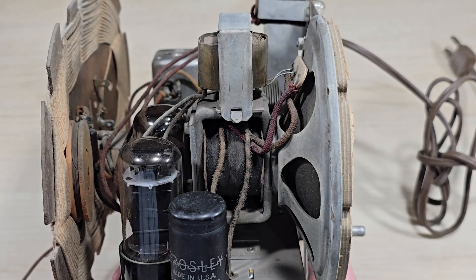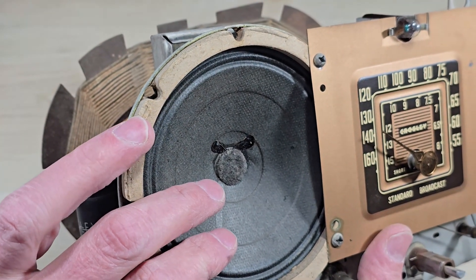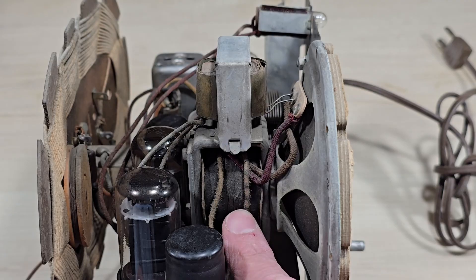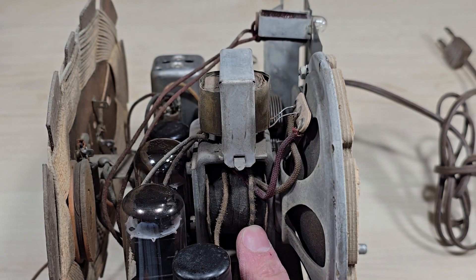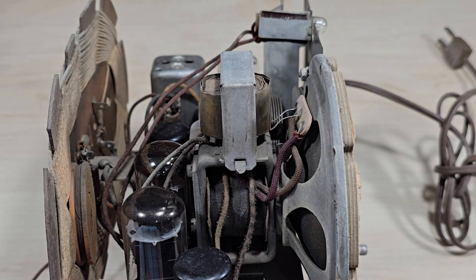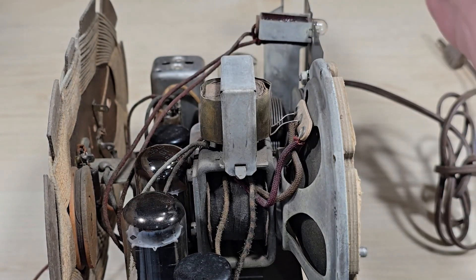This set has a unique speaker with multiple coils. The first is the voice coil, which moves the diaphragm. The second is a coil in the frame of the speaker that is used instead of a permanent magnet. It's interesting that it performs double duty — it provides the magnetic field for the speaker that the voice coil can move against, and it also acts as an inductor, as all of the energy or current for the tubes flows through that coil.